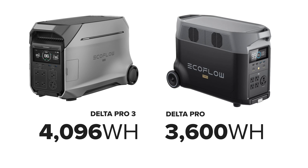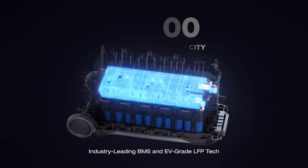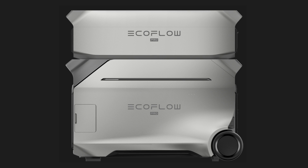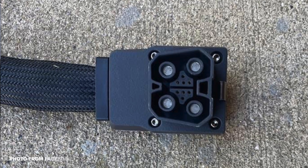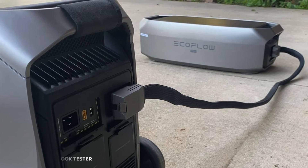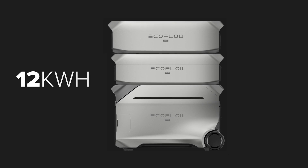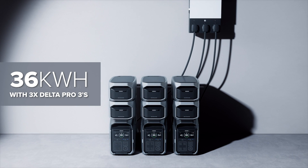The third feature is the batteries have been upgraded from a 3.6 kilowatt-hour battery pack to a 4 kilowatt-hour battery pack. The new battery runs cooler and is now rated at 4,000 cycles for an 11-year lifespan. They're also IP65 rated, so they're waterproof, dustproof, and fire resistant. The new 4 kilowatt-hour expansion batteries are miles better because they're smaller, stackable, and have low-profile connectors. The previous version took up a ton of floor space with bulky cables and non-stackable units. You can add two expansion batteries for 12 kilowatt-hours of total storage, or connect three Pro 3 units to scale up to 36 kilowatt-hours for massive runtimes.